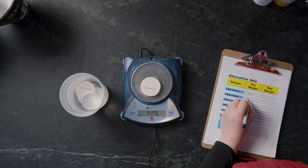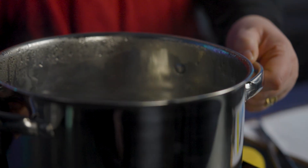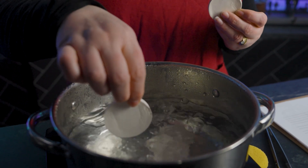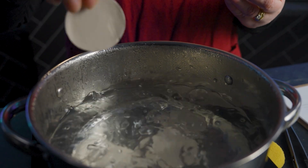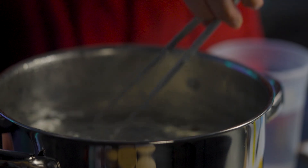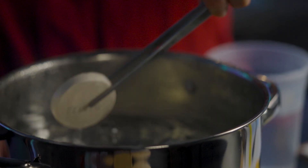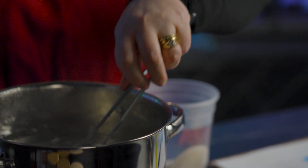After the firing, you need to weigh that sample and record the weight. Remember, it's not science unless you write it down. After you weigh the sample, it's time to boil it. The ASTM standard says that you have to boil the sample for five hours in distilled water. When we're testing in our lab, that's what we do. Lots of people argue that you can use tap water and boil for a lot less time. I don't think that's bad, but it's just not the standard — I would boil for at least two hours if you're not going to do the full standard. After you've boiled, turn off the heat and allow the sample to cool down to room temperature. The ASTM standard says to wait 24 hours, but it's okay to transfer the sample to a room temperature water bath to speed up the process.